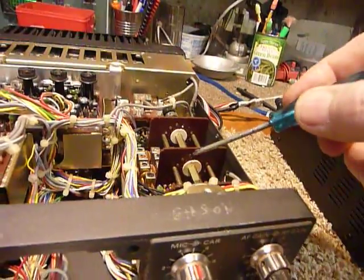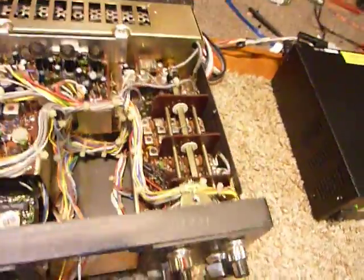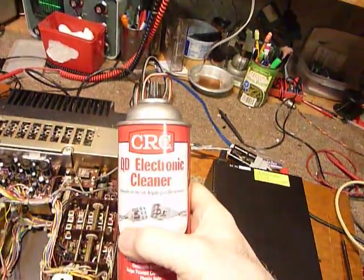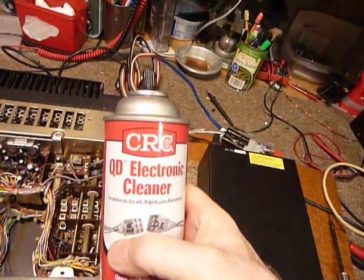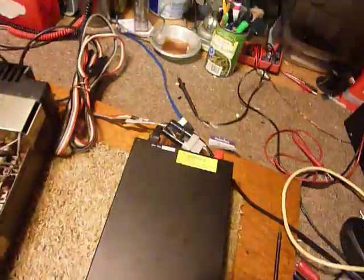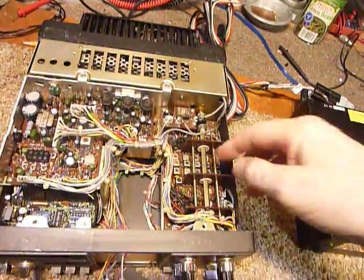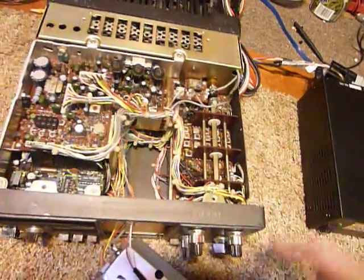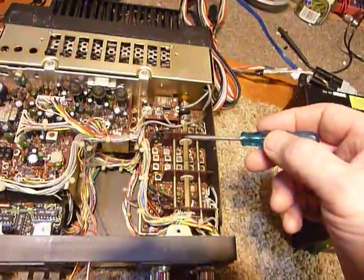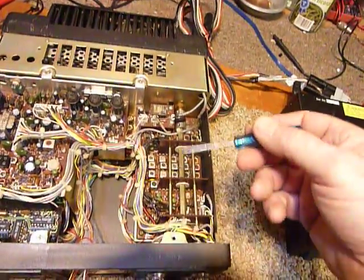You can also get right in here and put a tiny bit of contact cleaner on these rotary switches for the band, then run the band switch back and forth — I did that 25 times too. The contact cleaner I'm using is CRC QD electronic cleaner, and they have that at Walmart in the automotive department. I spray it into a very small cup or bottle cap — I do not spray it directly inside the radio. Then I use a very small screwdriver, dip it into the cleaner, transfer it to the switch contacts on the back of the switches, and rock the switch back and forth 25 times. There are three switches, so I do all three.